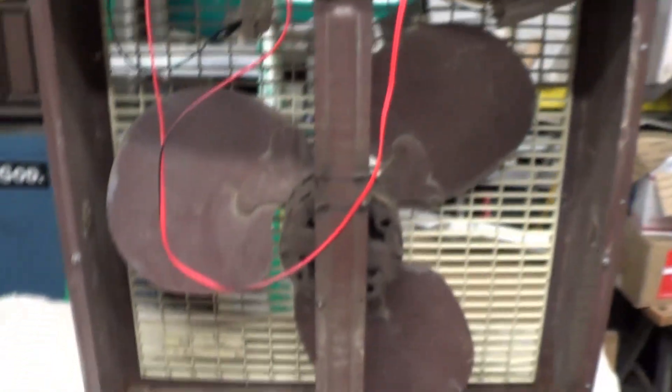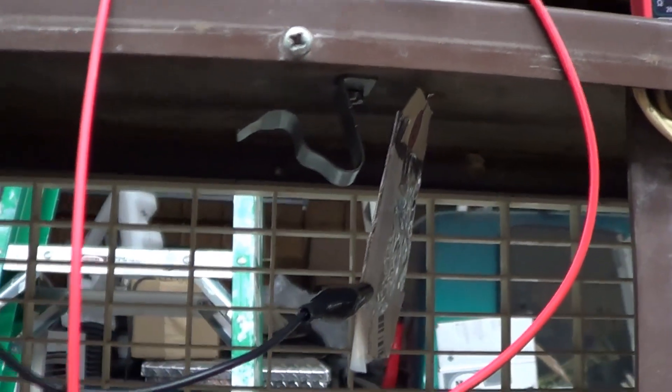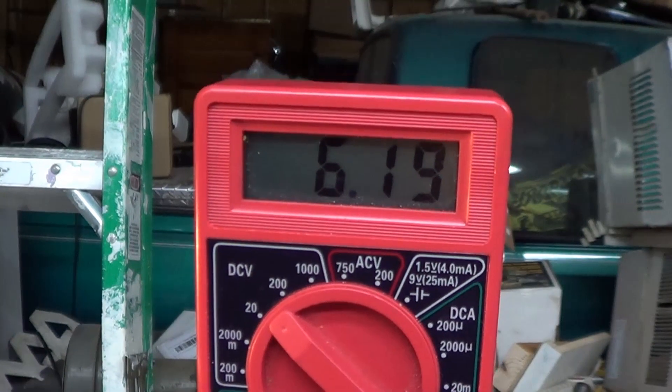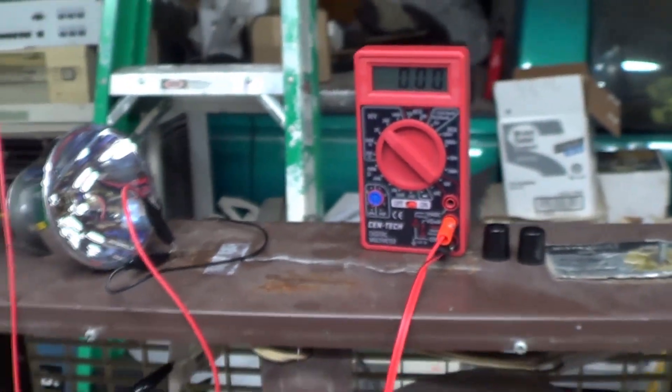And here's a battery that serves to power it. I'm going for the electromechanical approach involving a box fan that I picked up off of a scrap pile somewhere, a hang tag made of manila paperboard covered with aluminum foil and attached to the battery with a clip lead. And then up in here, we have a slot blank taken from a small form factor HP computer with a bad motherboard that I just recently finished scrapping out. The idea is that as the fan paddles go by, they will bump into the paperboard tag, push it into the slot blank, an electrical contact will be created, and the bulb will come on. This voltmeter, attached to the same circuit as the bulb, will indicate that there are no shenanigans going on — I'm really doing this 100% for real.